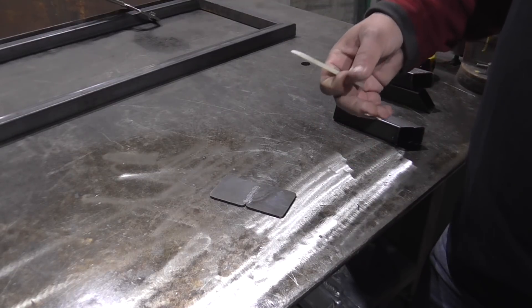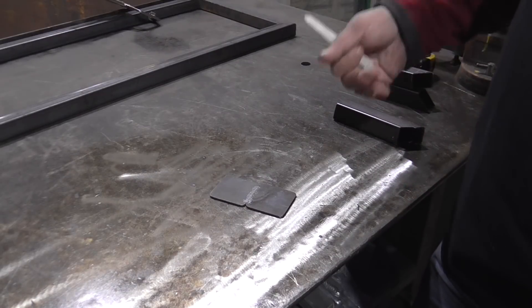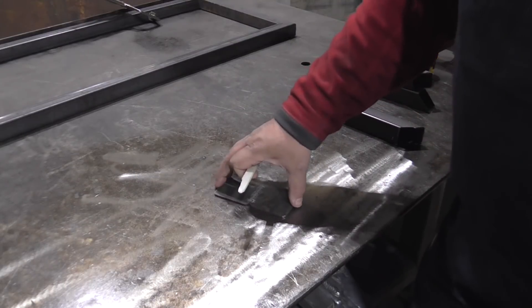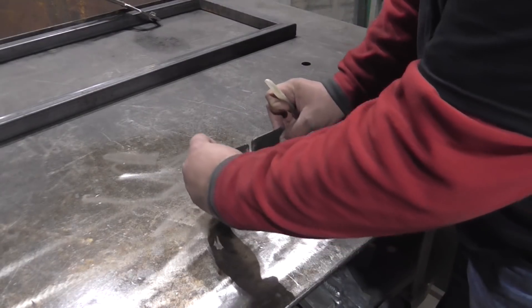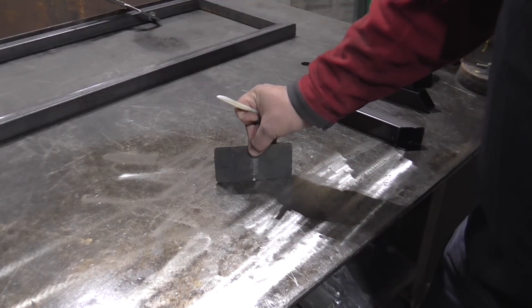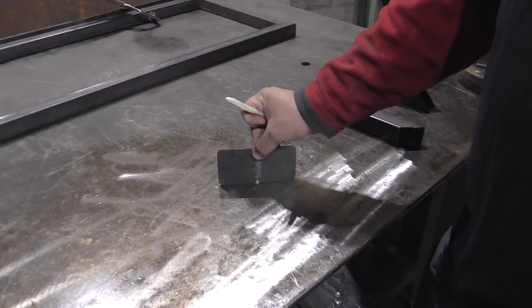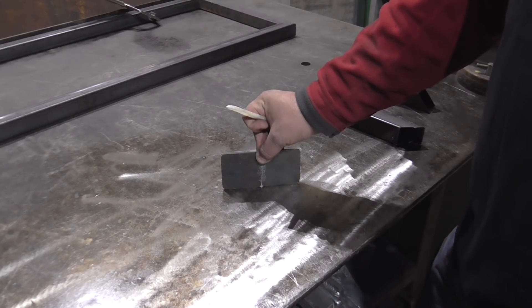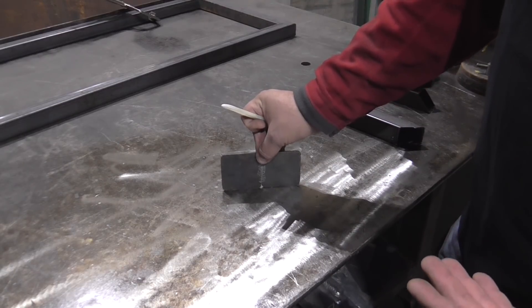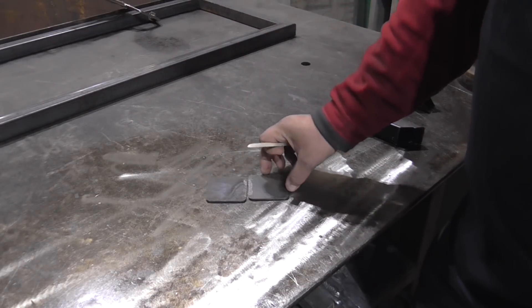That's flat, position 1G. If this whole thing happens vertically, it's a whole other animal. Welding vertically up, you need a lot less heat setting on the machine to keep the wire from getting drippy — especially if you use ER-70S6 instead of S3 wire. The silicon in the S6 wire makes the puddle more fluid and more prone to drip. So you typically use reduced settings for vertical up, and slightly reduced settings for overhead versus an in-position weld.